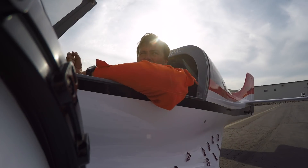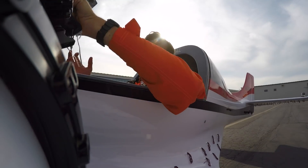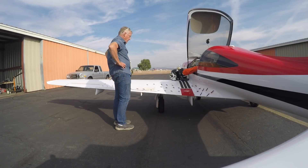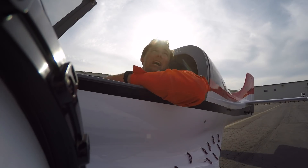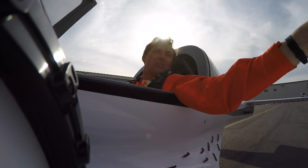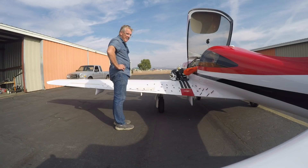There's buffeting on the elevator, and then the force just goes away. I can take it all the way to the stop and all it does is increase the chance of dropping a wing. Airspeed doesn't go down, but the range of motion is huge — we'll look at the tapes. Without a wingtip, all we have is cockpit data, but that tells me we're stalling the elevator.